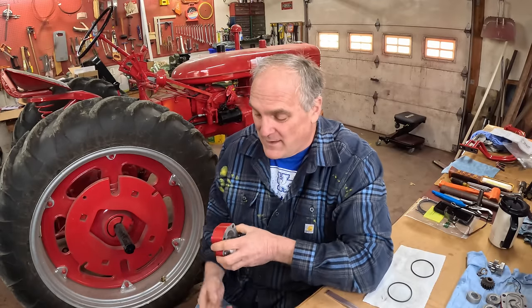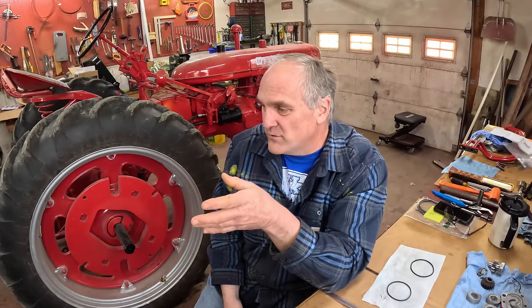It's a couple days later and I have answers and I have parts. Sorta. Here's what I found. Although the original Super C tractor only came with Thompson and Pesco pumps in them, I have neither. What I actually have is a Worcester pump. And when production moved out of the Super C and into the 200, the 230s, the 130s, the 100s, the 140s, there were actually four pumps in the mix over the whole time. There was Thompson, Pesco, Worcester, and Cessna.